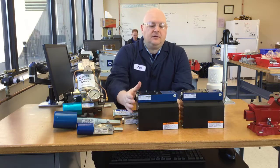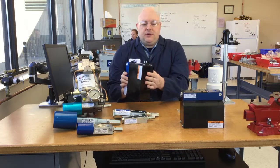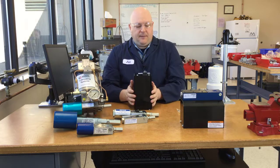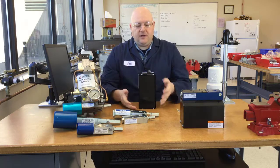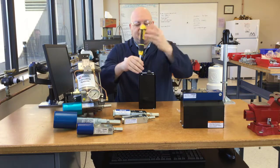The electric pump is available in AC or DC versions, and from the outside they look identical. The AC is a bit heavier because the motor inside is heavier. To open up the pump, you can remove either of the two opposing screws but just loosen the other two so that you can use them as a hinge.